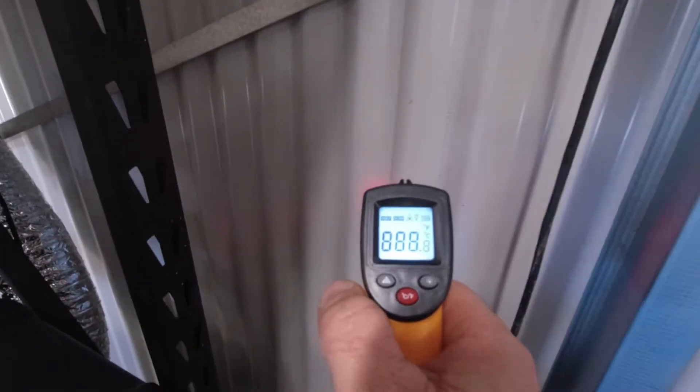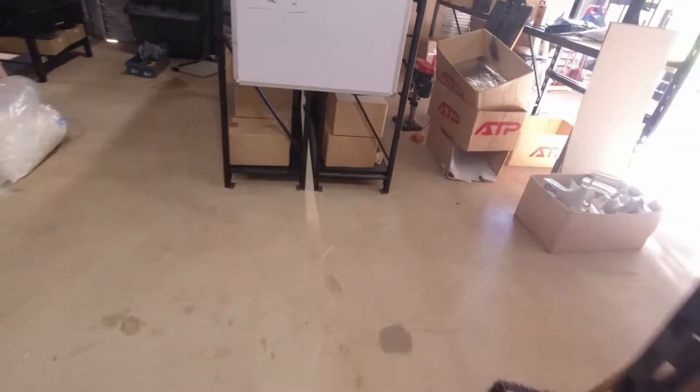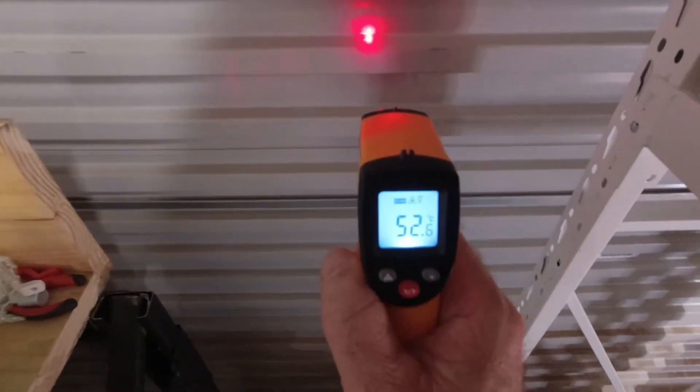I think that's a result because I used to have the machine against this wall, and in the last couple of days I've moved it over to this side of the shop. The simple fact is I've got 27 degrees on this wall and 52 degrees on this wall. I've got this really large aquarium chiller and it simply just couldn't keep up being next to a really hot wall. I really hate aligning the mirrors but I'm going to leave it as a job for another day.